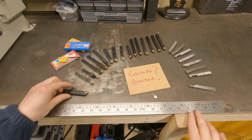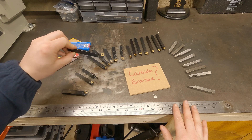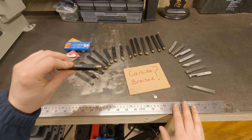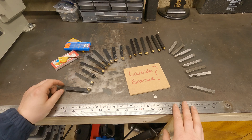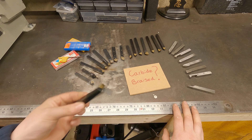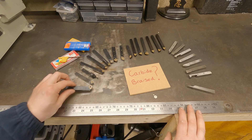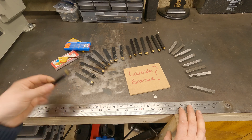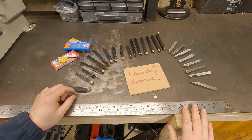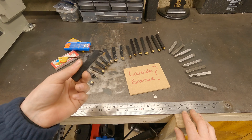The reason I've got a vast collection of carbide insert tooling compared to high-speed steel tooling is I just like the convenience — when an edge gets blunt, just being able to rotate it and swap it out is so easy. A lot of people on YouTube and forums will tell you that for a mini lathe you don't need carbide insert tooling, it's a waste of money. I'm here to tell you that is rubbish. Without this carbide tooling I would not have been able to do the lightsaber project — I tried using high-speed steel tools and they just blunted instantly because 304 stainless is so much harder.